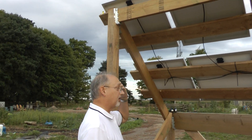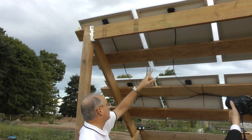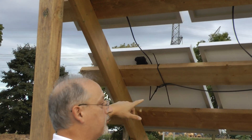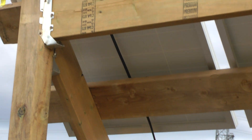We're looking at the back side of the panels right now. You'll notice that we have a wire that comes in the vertical direction on each set of two. That wire is used to put the two panels in series, which allows us to increase the voltage so that rather than being a 12-volt system, it becomes a 24-volt system.